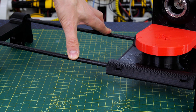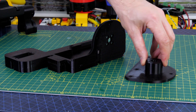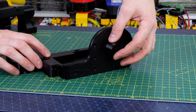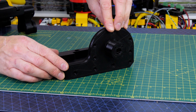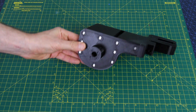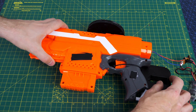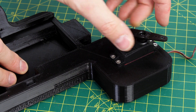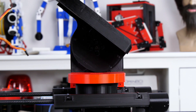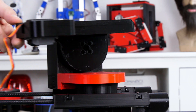There's a bit of flex in those carbon fibre rods, but I don't think it will be an issue once it's attached to the top of the dog. Now we're onto the rest of the second axis which is going to hold a foam dart gun. I've printed these parts in different orientations so when they're put together and glued and screwed it makes a super strong hub to go onto that second servo. I've keyed the sides, glued them with superglue, put a bunch of screws in, and mounted a normal RC servo that's going to pull the trigger via a spring. With both axes assembled, that moves freely in pan and tilt, or pitch and yaw.